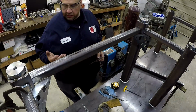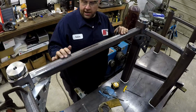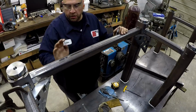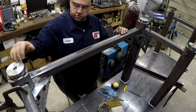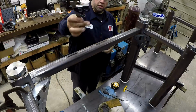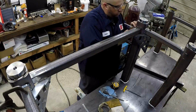I actually decided I need to make these pieces here 22 inches outside to outside, because that's what the 2x12s, once both of them are laying in here, I'd like to have them even. So the outside to the large posts are 24 inches, so that means just 1 inch from this face inward. I'm just using a combination square and just setting it in 1 inch.